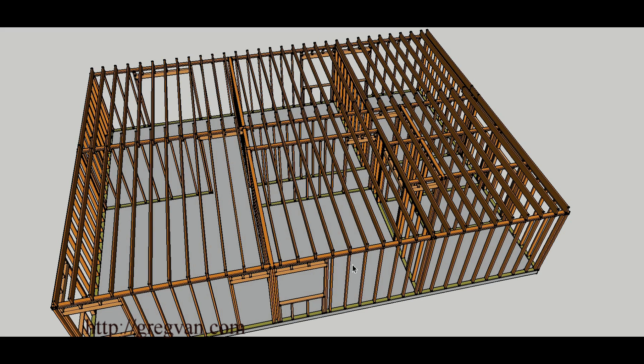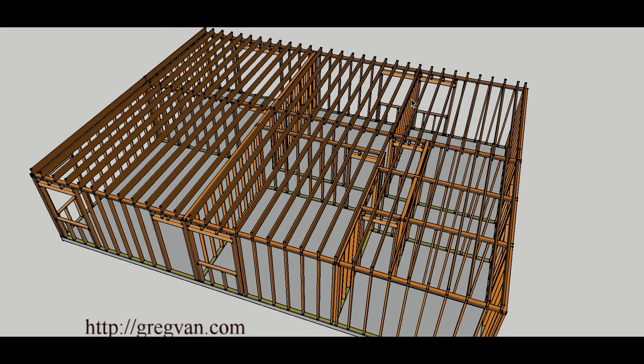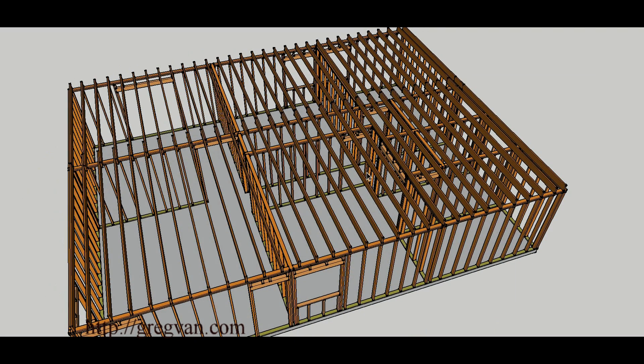This would be a non-load-bearing wall. The bearing wall is right here where they're breaking. This area would pretty much be non-load-bearing, but don't forget that a wall going all the way across — even if it's not a bearing wall — could be providing strength to the exterior walls, that lateral side-to-side strength. If you say 'I've established this is a non-load-bearing wall, I'm going to remove the entire wall,' then you've just weakened the structure of the building. That is the main point I'm trying to drive home.